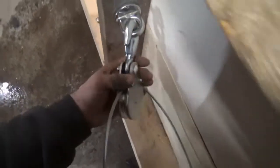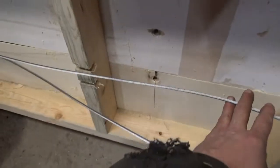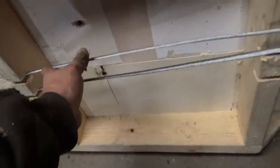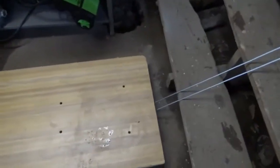I may have it reversed in the pulley. This one will go this way — no, that's right. This one will go in that guide, this one will go in that guide. Yeah, I think that will work — everything is parallel. Okay, good. We're good. Let's tip it over. We've got it strung the right way, lines are parallel, going down to the pulley and up. Let's see if it will lift it. I cut some grooves in here as guides and they may be a little too deep, or I may need to put a 2x4 out here at the edge.